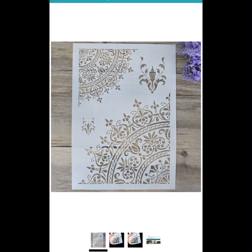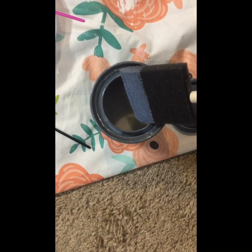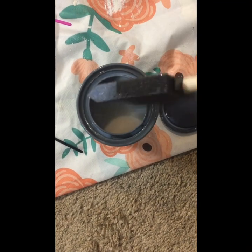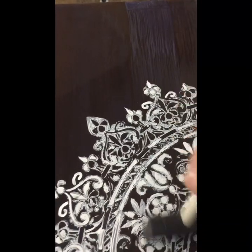When I did that, you can see it kind of accumulated beside all the bumps, so I used a stencil I got from Amazon to cover it up. This is my first time using a stencil so it was not perfect, but at least it covers up that part, which I'm happy about. I decided to apply the top coat on top of the stencil to seal it as well as the entire top surface, using polycrylic from Minwax in glossy, because I wanted a little bit of shine.